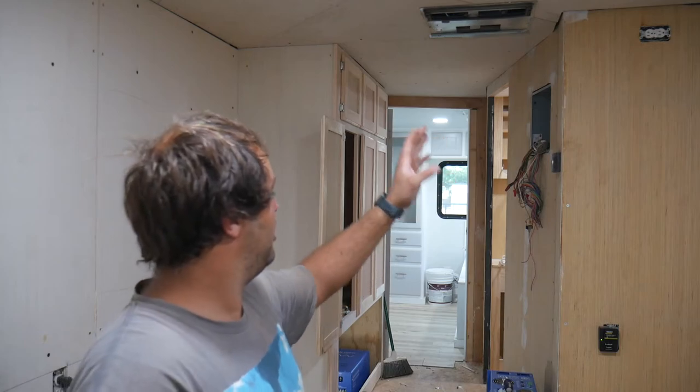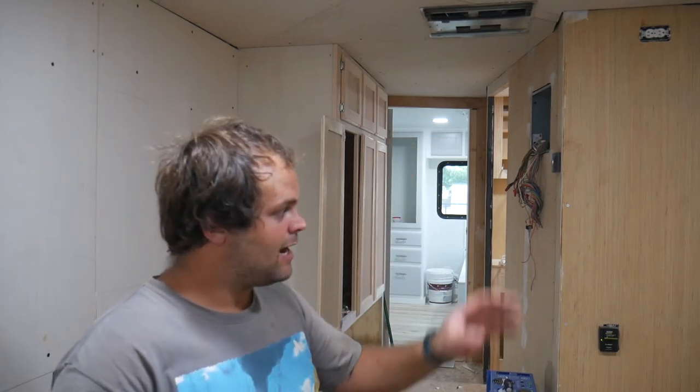It absolutely will work in a situation where you're coming into an RV park and you want to shut your generator down and run it for 20 or 30 minutes while you get hooked up and plugged in. Absolutely will handle that. My idea behind the inverter was you could run an air conditioner in front, an air conditioner in the back, a microwave, the water pump and something else. Even if that inverter is slightly overloaded, on and off as things come and go, it would handle that. But I didn't really think of it as an actual 6,000 watt power supply.